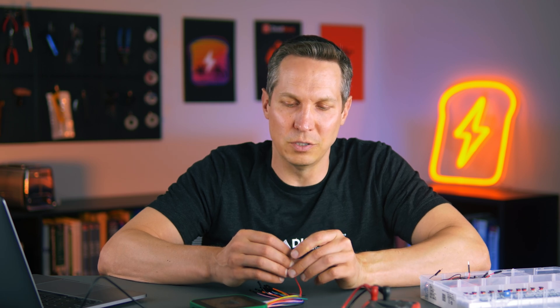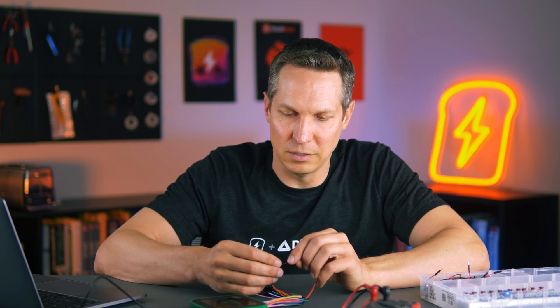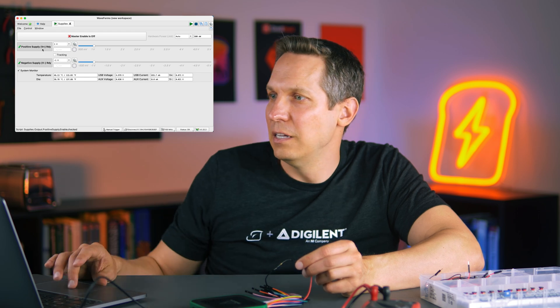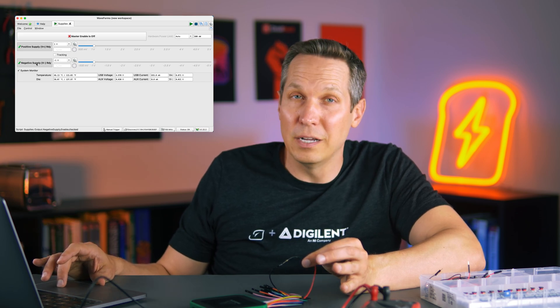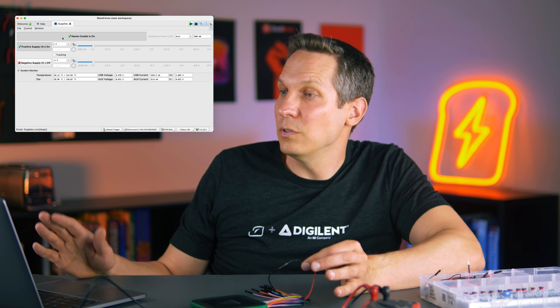So what I can do is take my resistor — you can do this any other way, you can put it on a breadboard or whatever, but I'm just going to put it in directly. I'm going to stick my resistor right into the V plus pin, and then stick the other lead into ground, which is just black and says GND on it. So now if I go back to my software and look at my supplies, I see I have a positive supply V plus at one volt with that check mark, so we know it's on. However, the master enable is off. I'm going to turn off the negative supply since I don't have anything on it, before I turn on the master enable.